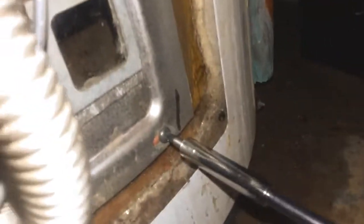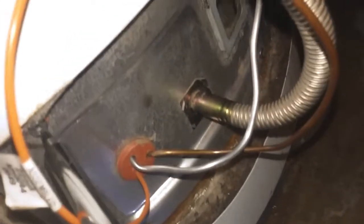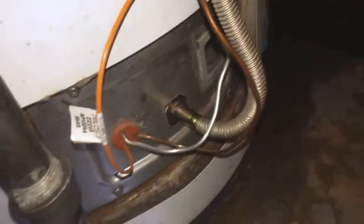And the thermocouple connects over here. So I'll tighten these three and then put the screws back on. Make sure you have tightened the screws. It's a little difficult to align them, but don't tighten them unless you have put all the screws in their respective positions, and then it should be sealed very well so that no gas escapes from here.